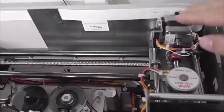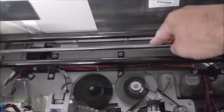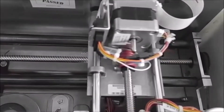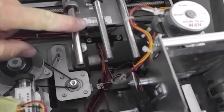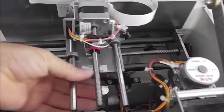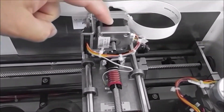Inside the machine we'll go from the back to the front. This is the transport module — it's the entire thing. It has these shafts, including this lead screw shaft which drives the picker. There's a belt-driven stepper motor down here that drives this back and forth with that lead screw. This is the picker carriage on the transport module, and it has this lead screw that operates on the belt and this stepper motor on top.